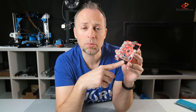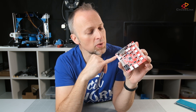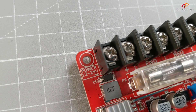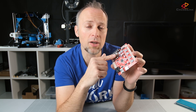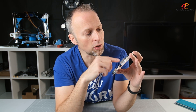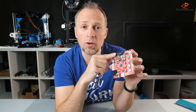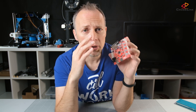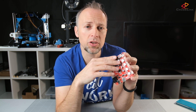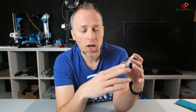Those are the two most important safety upgrades on the board. You'll also notice something written in the corner of the board: 'Power 12 to 24 volts.' That's impressive because it means you can drive this board with 24 volts, which could mean the heat bed and hot end heat up much faster. That does mean switching out your power supply, but I'm definitely going to test out a 24-volt upgrade for the A8 to see how much different the experience is.